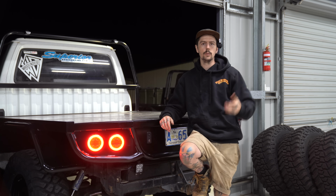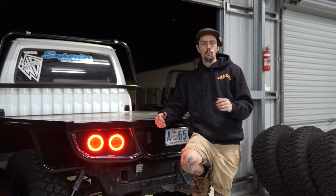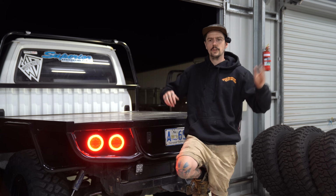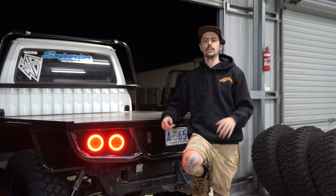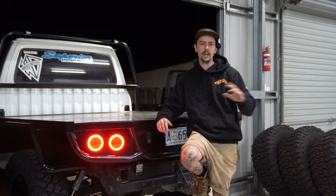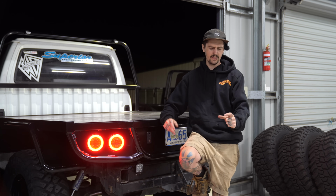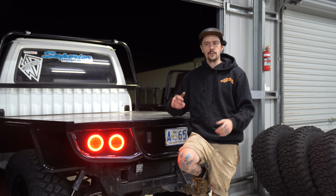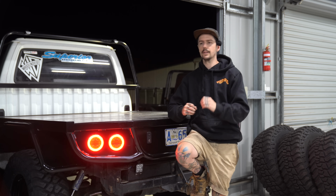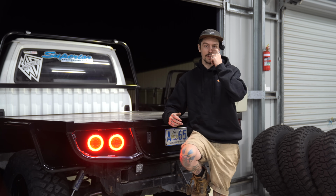I had the car sitting here with just the stick in reverse so that it didn't roll away. When it was time to roll the car back by hand to get the tray onto it, I knocked the stick out of reverse like I've done 100 times, and it jammed up. And I mean jammed up, like one of the selectors actually got pushed into fifth. So the gearbox was stuck jammed in fifth gear, except the stick appeared to be in neutral. I tried rolling it forwards, back, rocking it, hitting the stick, grabbing the stick, moving it around, and I don't know what went wrong, but that box just locked up entirely.